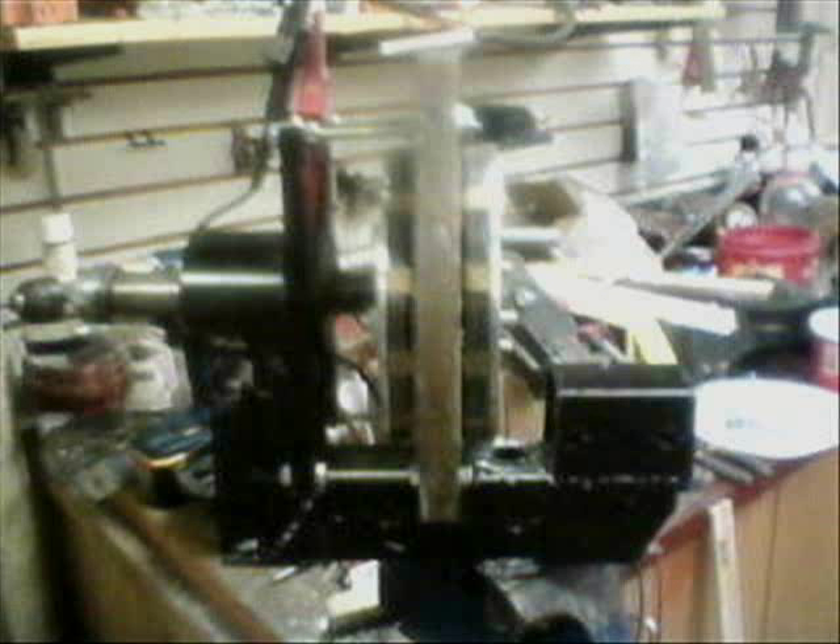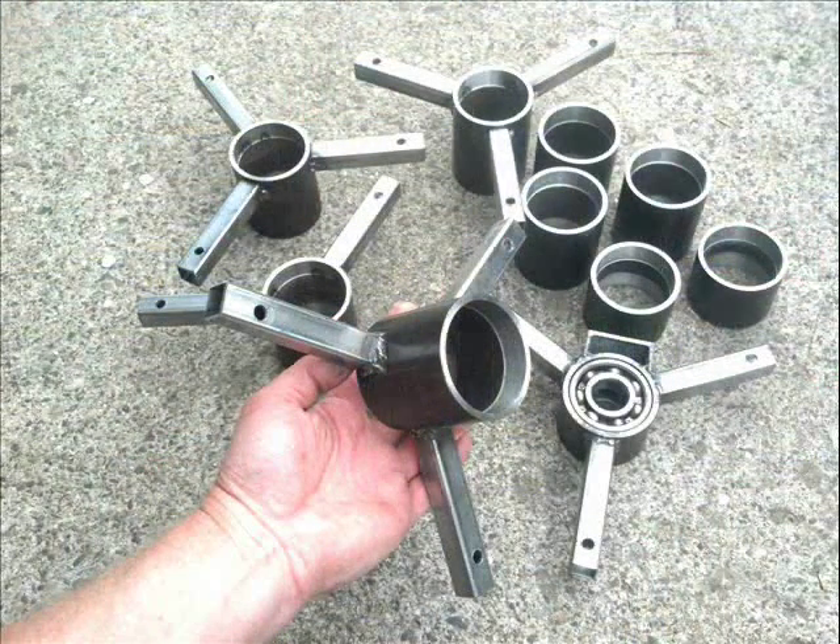So I went for the final assembly, and the frame was in the way. But Boomer's got a table router that makes fast work out of polyester resin, so I set the stator in place — it fit real nice — and I drilled four holes for the stator mounts. The first hole went fine, the second hole went fine, but the third hole went through a wire and the fourth hole went through two wires. By my calculations, we figured we had a 25% chance of still having one phase undamaged, and we wound up on the lucky side. After several hand-crank tests with a digital tachometer and several calculations, we figured it would take an 11-mile-an-hour wind to turn the prop at the RPMs needed to reach charging voltage. I will repair that stator and get some better tests out.